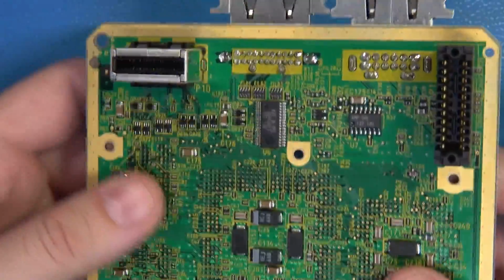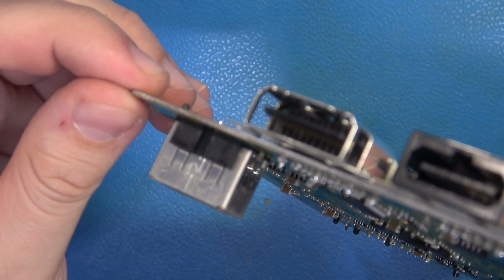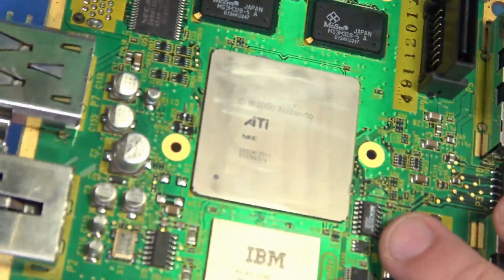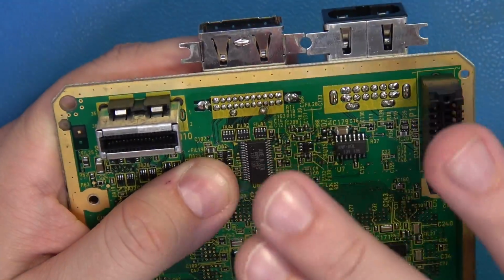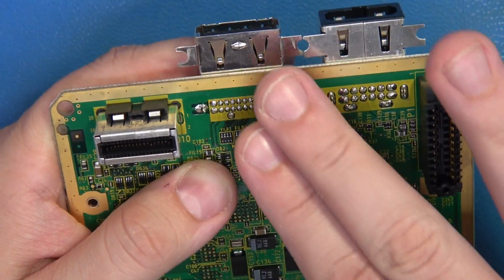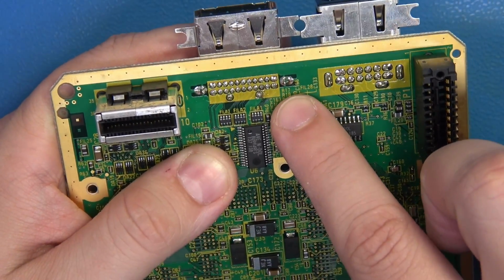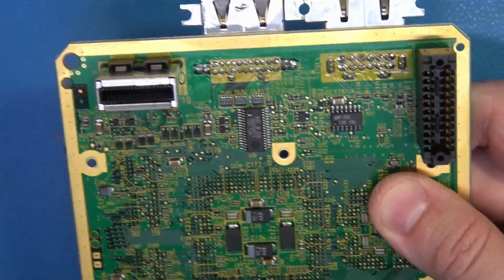It's great. But we're dealing with a through-hole component that's going through, I would guess, maybe 1.4, this could be 1.6 millimeters thick FR4, pretty sure this is a 2-layer, could be 4-layer, I'm not sure. The point is, that solder system is not going to do a lot for getting heat into this main board. It's great for lowering the melting point temperature of solder, but our real enemy here isn't the solder system used during the wave soldering process. Let me zoom in and I'll explain.